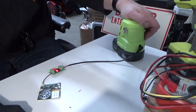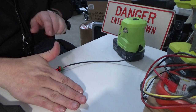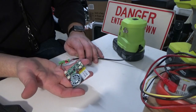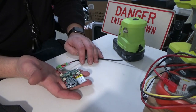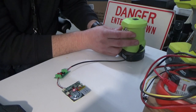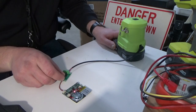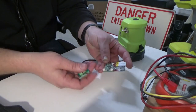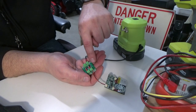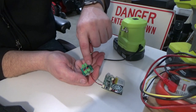Took it up to power, hit it with 20-something volts — hey, it works! You can change the programming on this thing. It should play once and then stop, but you can set it up to continually play the sound until the trigger is removed. I'll link this little board below — it's fairly cheap on Amazon, it's actually an MP3 player and you configure it with a text file on its storage. Turning it off also triggered it — interesting.